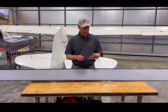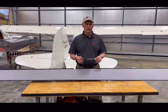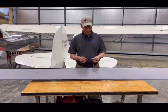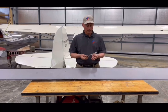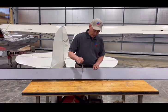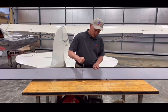This is a tester that we got from Airtek, which is a Quicksilver supplier and manufacturer now down in Louisiana. This is actually made from a belt tester. It's calibrated in pounds of downward pressure — it's got a little O-ring on there. What we do is we slide the O-ring all the way up, put it on the fabric, and we just gently push down until it pops.